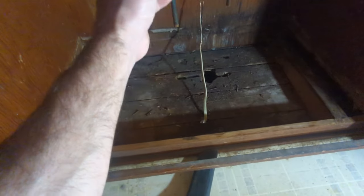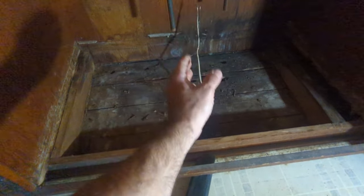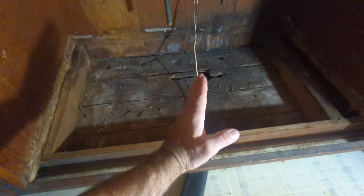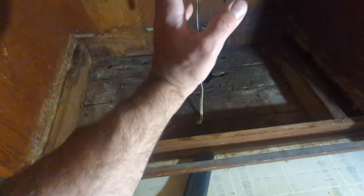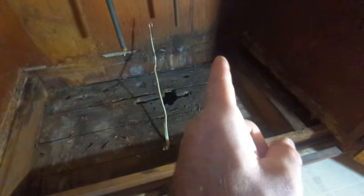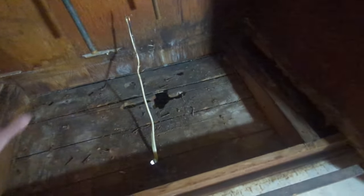You want to fall straight down because the water can cascade over the edge and go down. But there's almost always an air route past it, because the water doesn't seal completely, and that's a best case scenario. So at this point, we're going to go into the back wall and down in there, so it keeps this area under the sink clear, and we pass code with what's called the P-trap. So it's one half of an S-trap, it's just a P-trap.